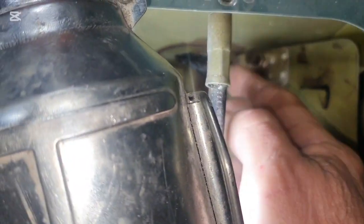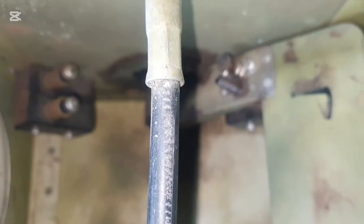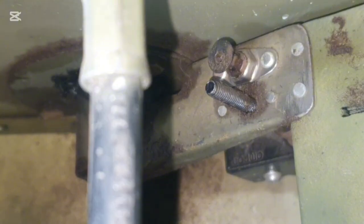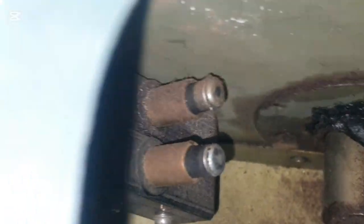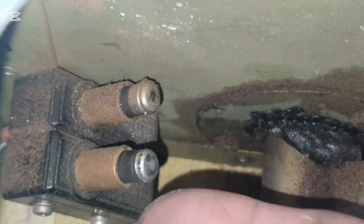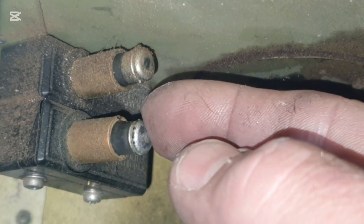What was happening was that actuator, which is supposed to hit the contact of the micro switch — unlike the one next to it which has got a nice broad pad on it, the top of a countersunk cap screw — the one closest to the camera doesn't have that pad on it. As a result, it's skidding on the wrong side of that pin there, so it's missing the breaker altogether, getting jammed along the side. So that's quite an easy fix.